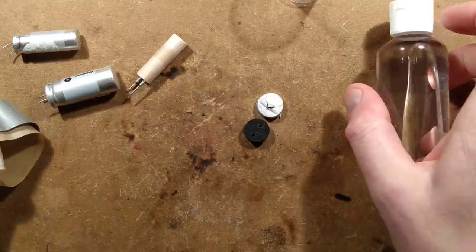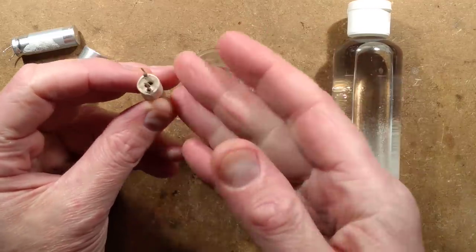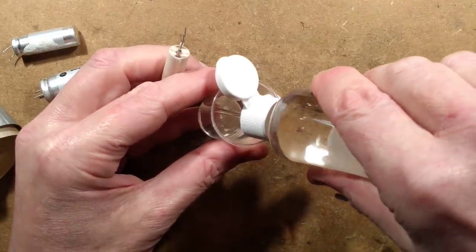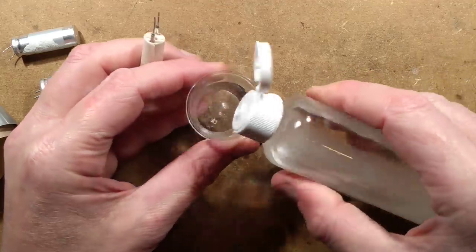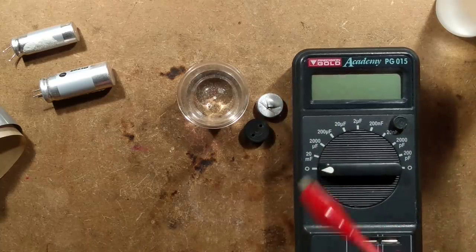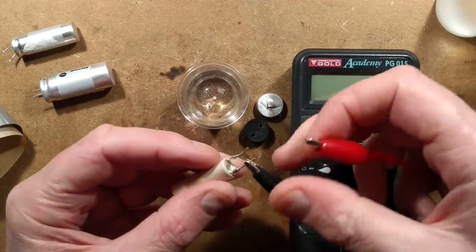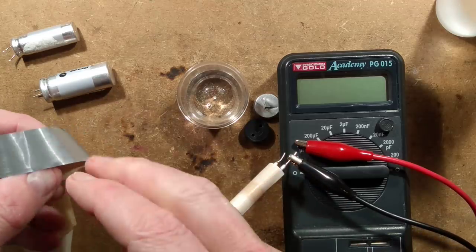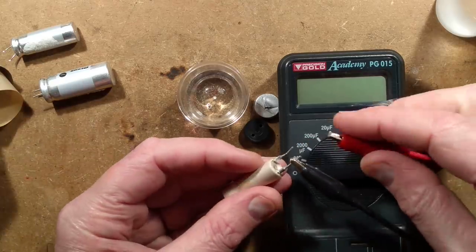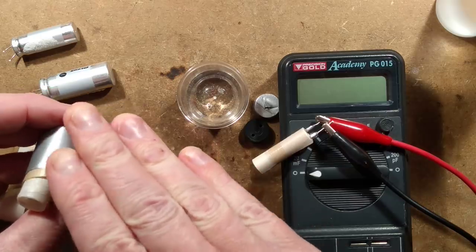One interesting thing here — let's connect the meter. I'm going to soak this and hopefully it's going to wick in itself. I get the feeling that to get the air out you'd need to pull a vacuum, but I'm going to start by squirting some of this in here and letting it wick up, just to see what happens. I'm going to hook up the capacitance meter and see if it changes. There is one slight downside: the capacitor may need to be polarised. Part of the process is that by applying a DC current, a protective oxide layer forms on the surface of the foil — that's how they can create such a large capacitance in a small area with that etched texture.